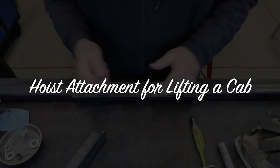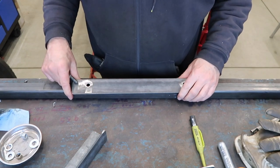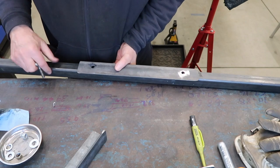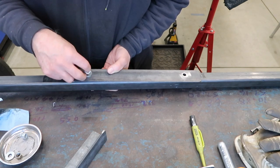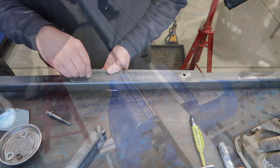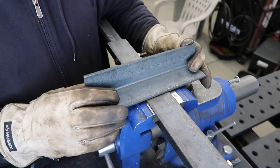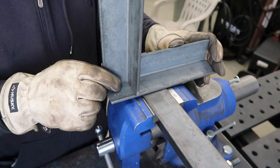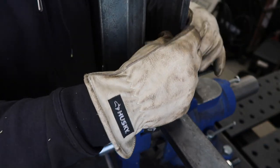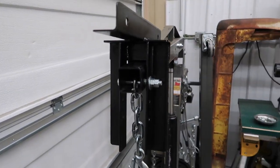To lift a truck cab, we'll need to push the arm from the bottom instead of lifting from the top. So we created an attachment for our engine hoist that will accept a lifting arm. We secured a 16 inch long, two inch piece of angle iron to the two holes in the lifting arm. We then used two inch angle iron for creating the rest of the attachment. The cross piece was 11 inches long and the two legs were each 16 inches long. After drilling the various adjustment holes and welding the attachment together, it was painted and attached to our engine hoist.